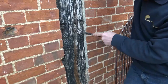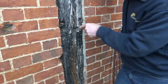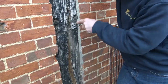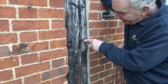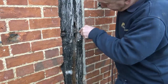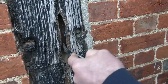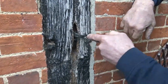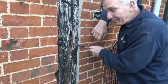There's a mortise in here, mortise there. You can see the original pegs. What do you do here? I think you carry on with what somebody's probably already done — there's a bit of lime in there. You could fill it with oakum, or you could just fill it with lime. At the moment it's free draining. Any water coming down here will hit that — that is the back of the mortise — and it's good solid timber at the back of the mortise. So any rain coming in here hits this and runs out and runs away. So it is not going to deteriorate.